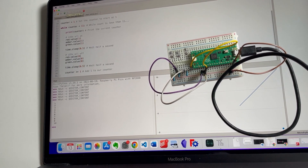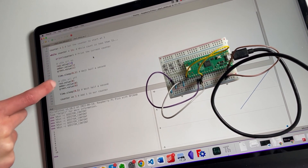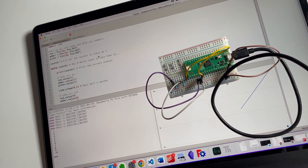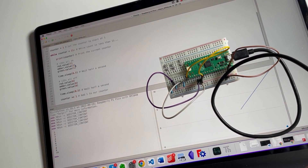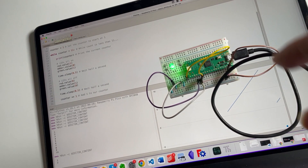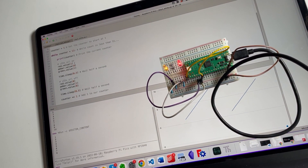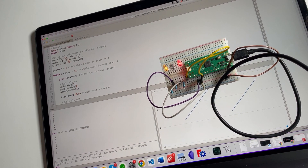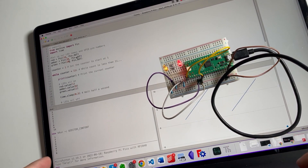What if I set amber to value zero and green to value one? That makes amber go — nope. We'll do this. See, because amber is actually green! So let's swap them in the code. Amber and green are actually pins 20 and 19.